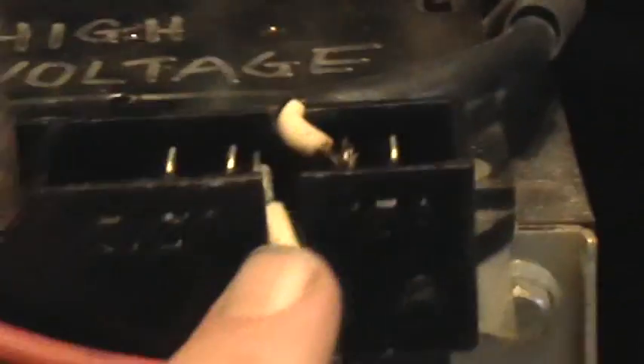This is the AC line input to the primary down here, and then this is the high voltage secondary that's sealed in plastic, and it has another secondary with just a few turns down here that provides the really high current for the magnetron heater. 3.2 volts at 15 amps is one of its outputs, so we're not using that, but we are using the high voltage output.